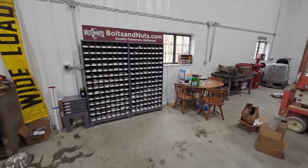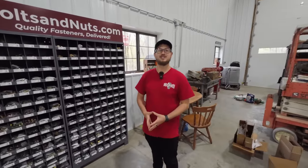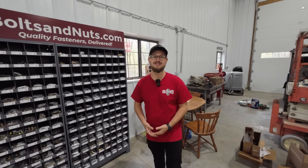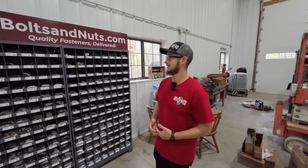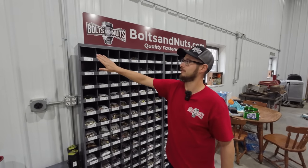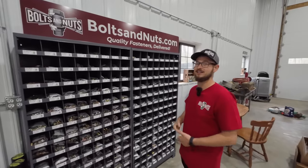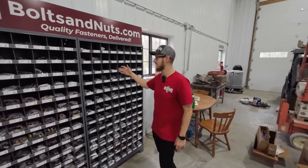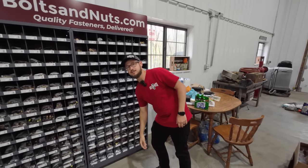Yeah, so Matt reached out to us. He said he needed a bolt kit for a shop down here. This is what we came up with. It's over 20,000 pieces, custom tailored to his needs. This entire kit is all grade 8 hardware. We go from 1/4 inch to 3/4 inch for his heavy machinery, both coarse and fine thread. And then we also have 10.9 metric for your metric needs, and all the nuts and washers to go with it.